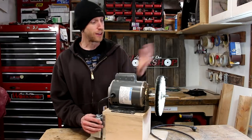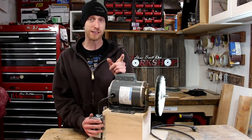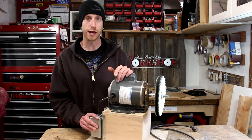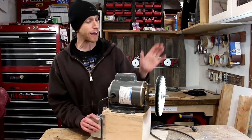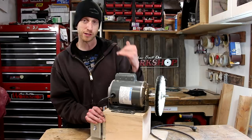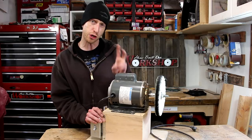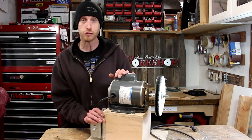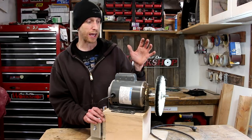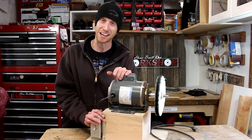The little thing seems to work pretty good — even though it's quick and simple, not fancy at all, it is effective and it will be getting some use here around the shop. I can already see this as version one though. I think this motor spins a little bit too fast for this buffing wheel — when I was buffing that guitar neck it was getting a little bit warm, so I think the speed should be a little bit lower. Maybe in version two I'll do a belt drive and reduce the speed by about half using different sized pulleys, and maybe do something different — maybe double ended. I've already got the gears turning for the next project.